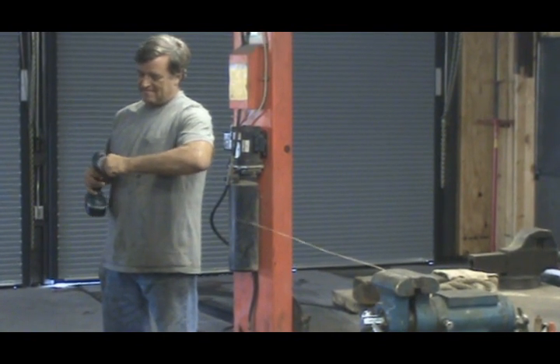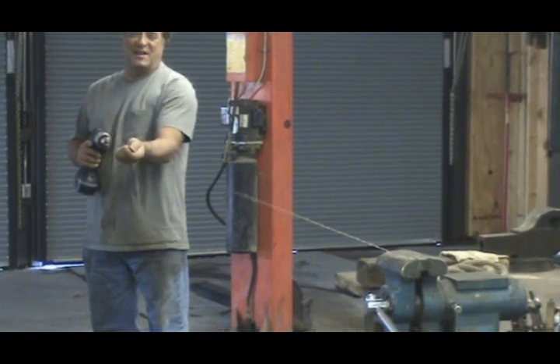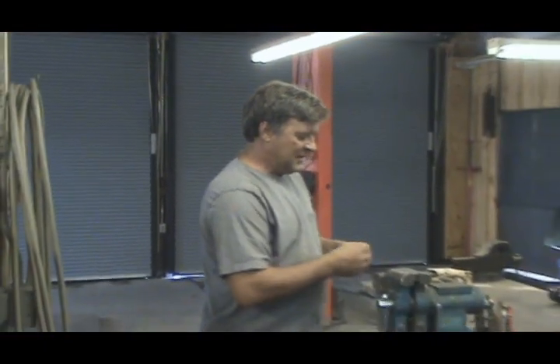Why don't you just use a single piece? Well, because it's so thin. A single strand would be so thin that I'd be feeding it as fast as a MIG welder — just going and going and going, trying to keep enough wire in there on the weld. And it's so floppy when it's just a single strand that it's hard to keep track of; it's always going every which way. So now I've got it twisted up.